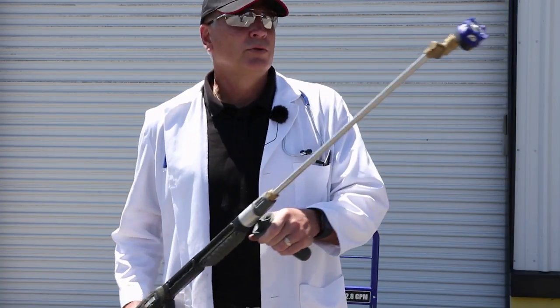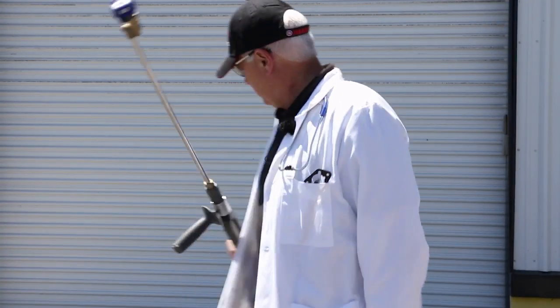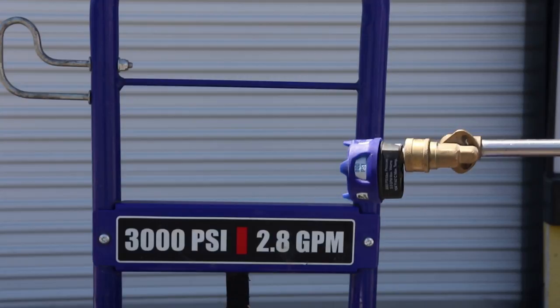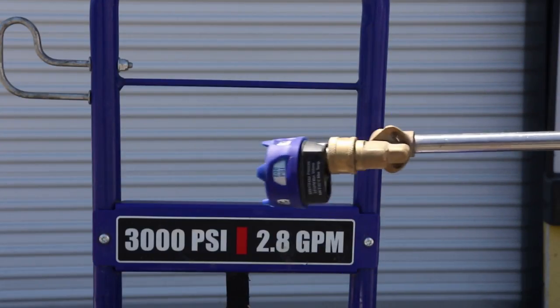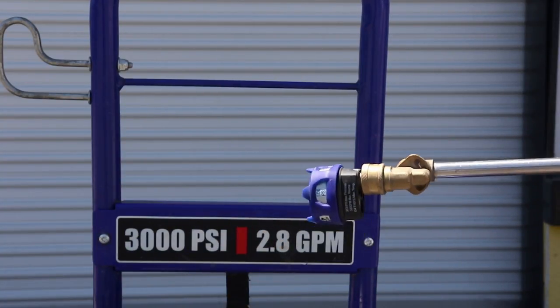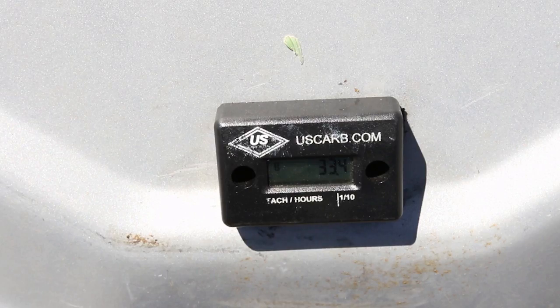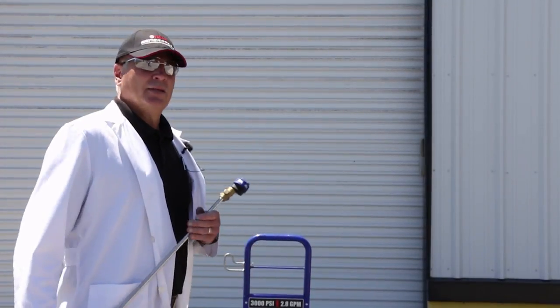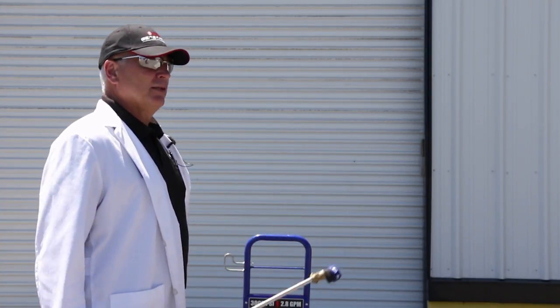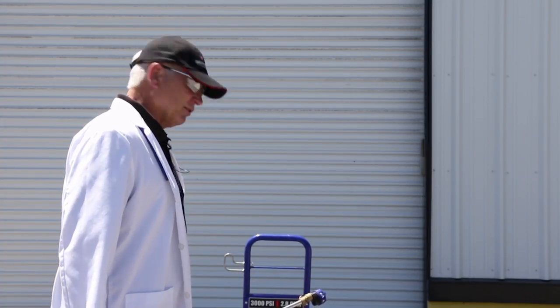Welcome to the Dr. Hugh outdoor segment today, and today we're doing a Yamaha pressure washer. It is a Yamaha PW3028 is the model number, if you'll notice on the side, but we can determine that also by the fact that most likely it's a 30, as in 3000 PSI and 2.8 gallons per minute. So 30, 28. So it's been on gasoline for 33.4 hours. We're gonna put a snorkel on it so that we can have it start and run better than it has been. We'll go ahead and run it now, and hopefully we can tell the difference when we run our propane to see the quality change in the adding of the snorkel.